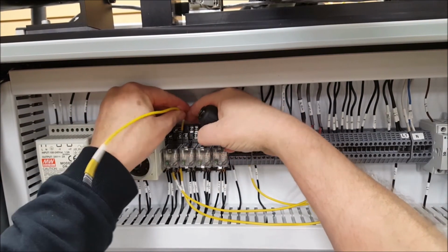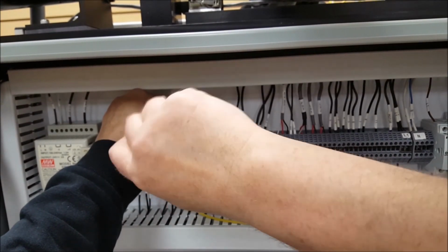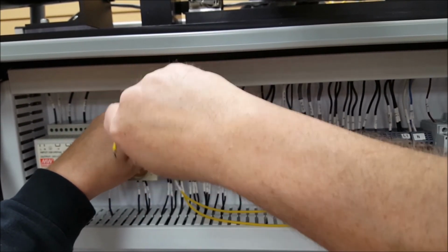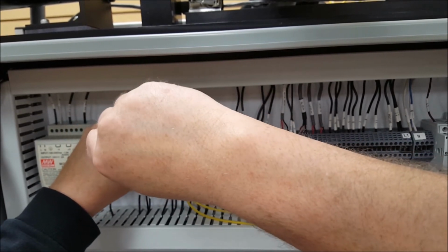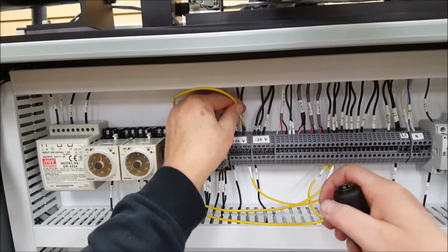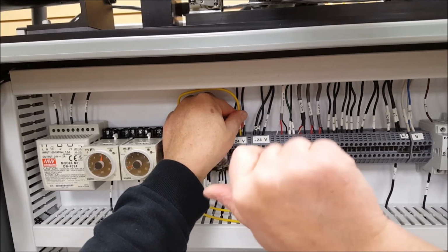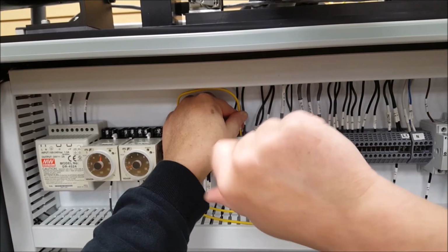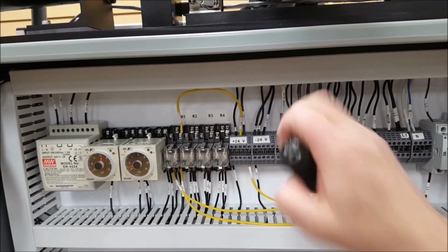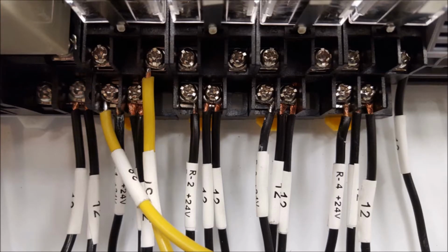And we have one more wire. That's to finish up node number 1, and what that is, lug number 5 on the relay block, which is our normally open contact, and that's our seal. So we're going to put plus 24 volts on the front of that contact seal, and when you energize a coil, this is what's going to actually seal that circuit in. So put it into plus 24 volts, tighten it down, and you feel it bite. Yep, we got a good connection, I think. Give it a tug, make sure. Okay, I think this thing's ready to run.